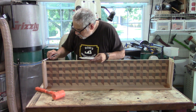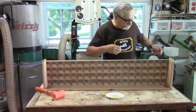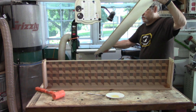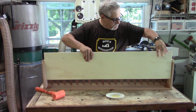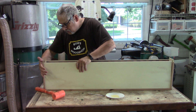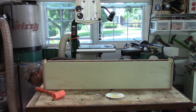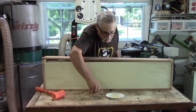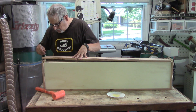When you're gluing in panels like this, whether you're making a top and bottom of a case or say doors, you never glue in the panels — you've got to leave room for expansion and contraction as the seasons change. The bottom here is plywood, and the substrate I used on the top is a piece of MDF, so not quite as critical on this, but still I don't glue in panels. I like gluing both surfaces — both the pins and the tails.